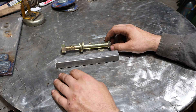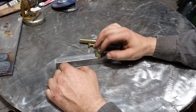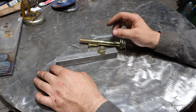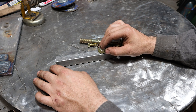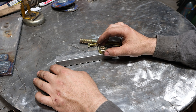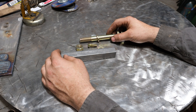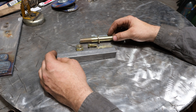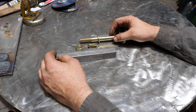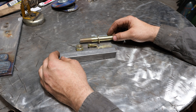I'll flux core or stick weld it, and prep is at a minimum — because honestly, this stuff welds terribly if you don't clean it, and even if you clean it, it generally doesn't weld that great either. So wasting a lot of time super-prepping this stuff is not really in your best interest. Now it's very common that I weld a nut like this onto something. In that case I'll buff it to clean material, then TIG weld or stick weld it, and that works fine. I'll generally hit it with spray paint when done to help prevent rust. When it comes to weld quality on this stuff, the welds are going to come out pretty poor. I'll put up some example pictures of stuff I made recently at work, which kind of sparked the interest in doing this video.